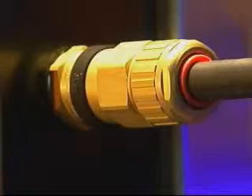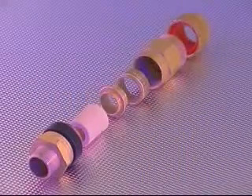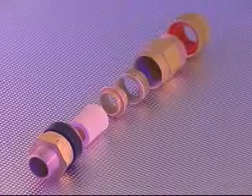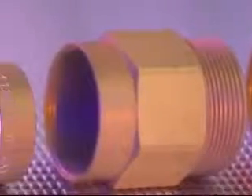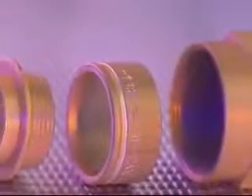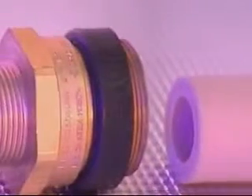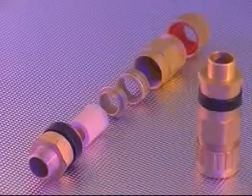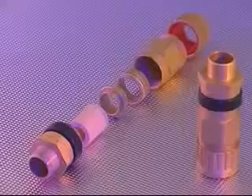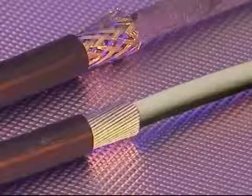General description of glands. The ICG-653 Universal cable gland comprises six major components: the back nut, middle nut, reversible armor clamping ring or RAC, armor spigot, compound pot and entry component complete with deluge seal. This cable gland accommodates all types of elastomer and plastic insulated cable, incorporating all types of armor, the most common being single wire armor and wire braid.